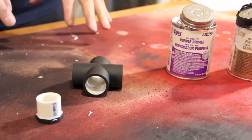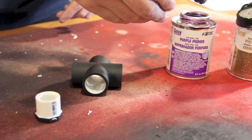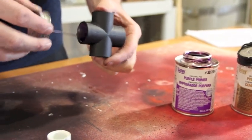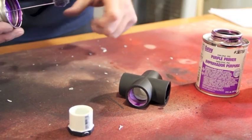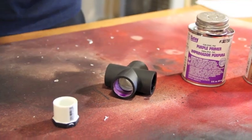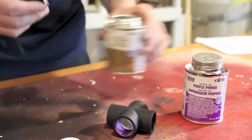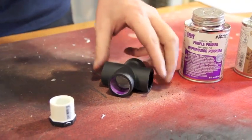Now we're going to break down our rig again and prep it for gluing by adding the primer. The primer is this purple substance which preps the plastic for gluing — just roll it around the inside. It's going to get on your hands and it's messy, but don't worry. Once it's dry, we go ahead and take the PVC cement. Once you break the caps on these, you'll realize you want good ventilation because it's quite potent.